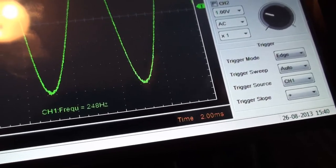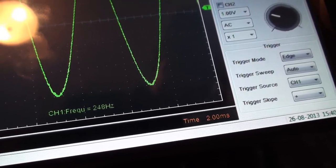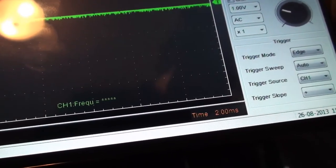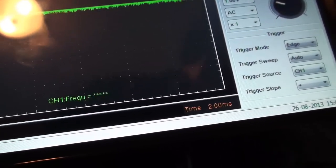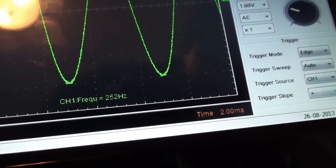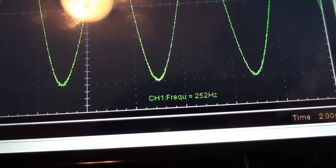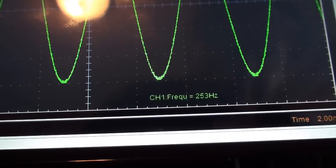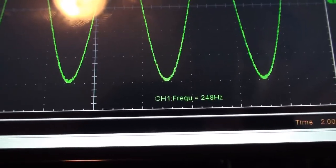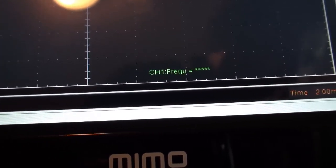All right, so once again, 248. Voice number 1, 248. Voice number 2, 248. Voice number 3, 248. And into no man's land, voice number 4, 253. I can get this to click on. Come on. All right. Yep, there we are on voice number 4. 1, 2, 3, 4 over here. VR14. And take that down to 248. Yeah, good enough.